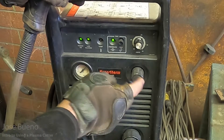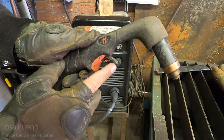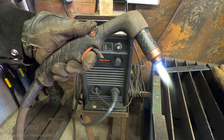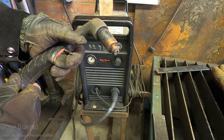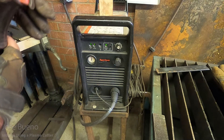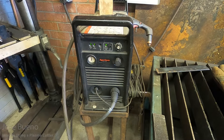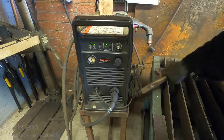One thing I'm going to demonstrate is that as soon as you pull the trigger on the plasma torch, you're going to activate the cutting gas. However, unless you hold it down, with this particular model, you're not actually going to establish the cutting arc. You have to hold the trigger down and then wait maybe a second or two, and then you'll see the arc. After you're done cutting, there is also a bit of a post-flow, which helps cool down the internal parts of the torch and minimizes wear and tear. Don't worry about your post-flow too much — if it's there, it's there.